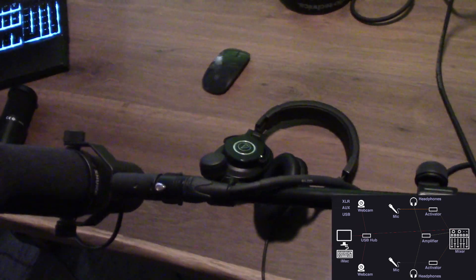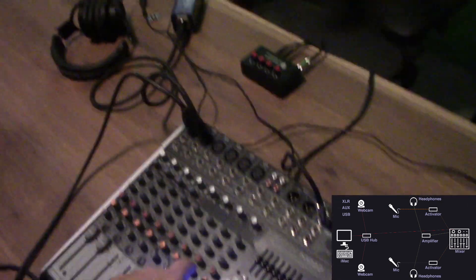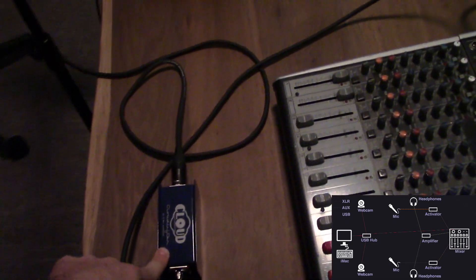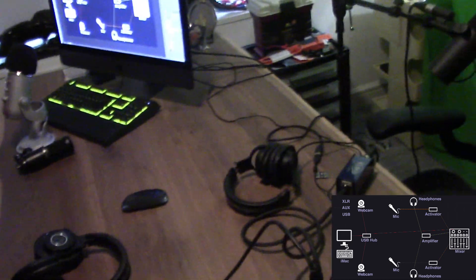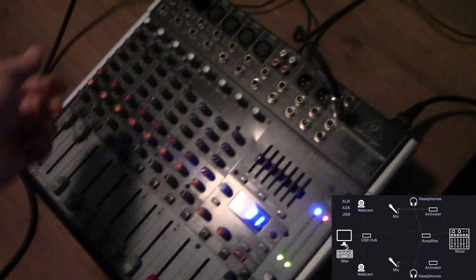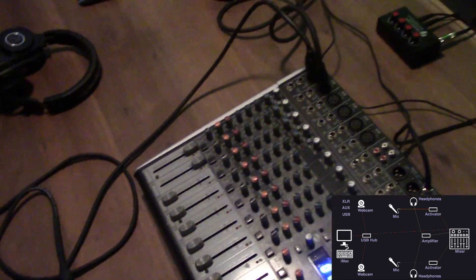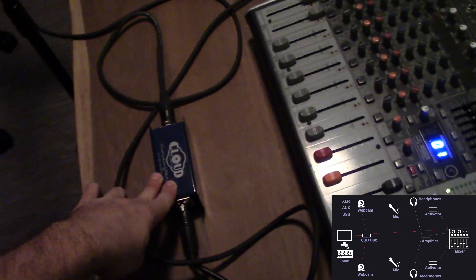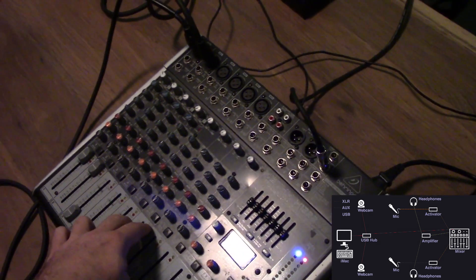This mic is mounted on a cheap boom that you could find in any AV store, and then it goes via XLR cable into the mixer. I also have these Cloudlifter mic activators in between the microphone and the mixing board. All they do is amplify the gain on the microphone — make it louder coming into the mixing board without losing quality, because these Shure mics happen to be really low-gain microphones. You don't actually need these; you can just boost the gain on your mixing board. But I like using them because I want more fine adjustment, and I'd rather have the audio be too loud and adjust it down than not loud enough. I definitely recommend these because they keep the audio quality sounding really good at high volume.